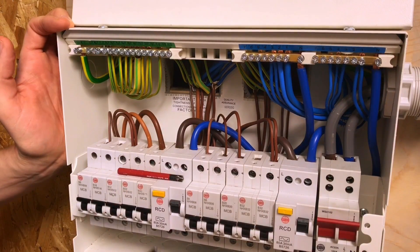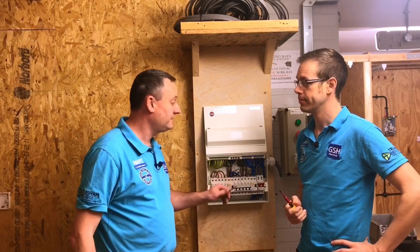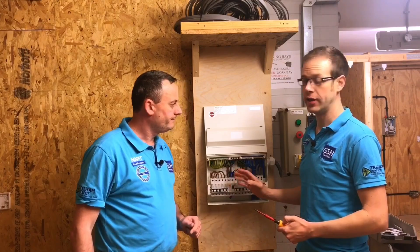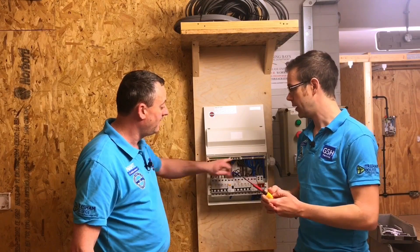So Joe, we're going to revisit this consumer unit a few more times in the future - we're going to talk about AC RCDs and A-type RCDs and the pros and cons of using each. We're also going to look at the stickers we'll need to put on the consumer unit. This video concentrated on making sure we've got the right torque setting on all of the terminals inside - every single one of these screws is now done up to the manufacturer's recommended setting. We also worked between the slotted posi two and the slotted posi one depending on whether we were on the earth bar, neutral bar, or circuit breakers. You've got to look at the screw head, match it up to the screwdriver bit, and make a judgment call on whether it's going to be a number two or a number one. We hope this video has been some help.